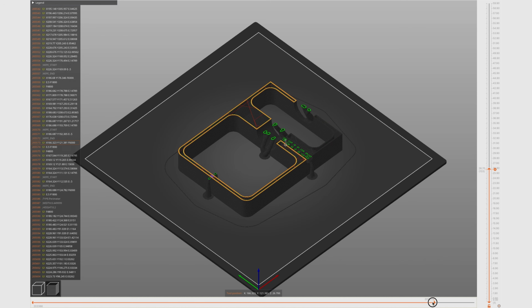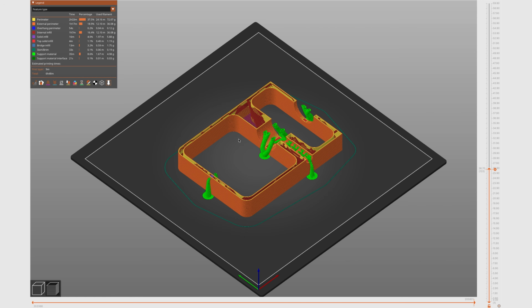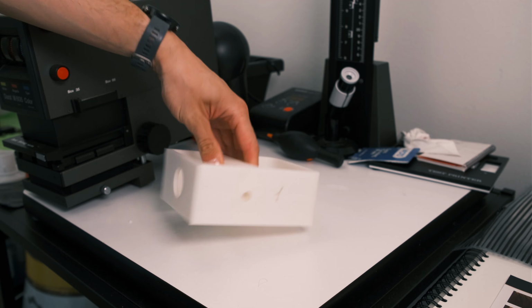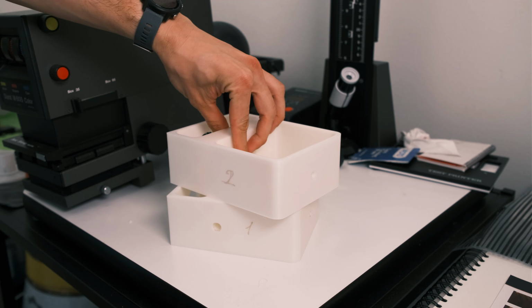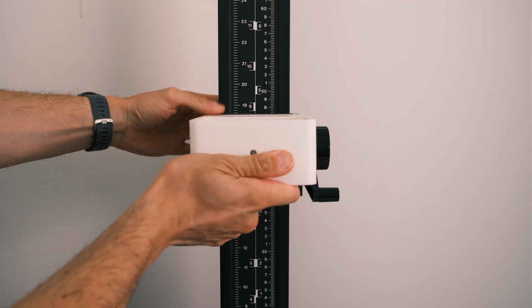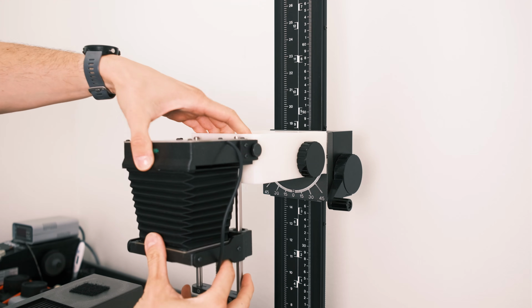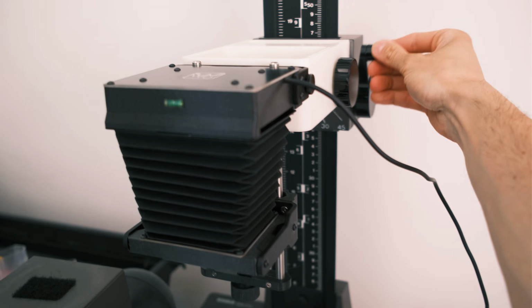And after several iterations and checking the fit, and which size and which offsets I actually need, I created the print. It was actually quite easy to make, because I have a little bit of experience and background in this field. After 3 prototypes I created more or less the perfect combination of the fit, hole position and the distance from the head of the enlarger. And as I said before, you can download this 3D model from the link in the description below. So I made quite a good fit, and when you screw the screw down through the plastic mold, you get a quite secure fit on top of the enlarger, and you fix it in the end with one simple tripod nut screw. And this is the whole setup.